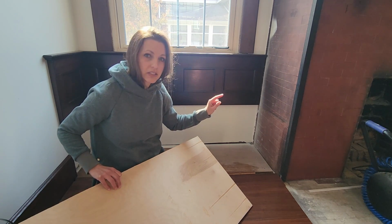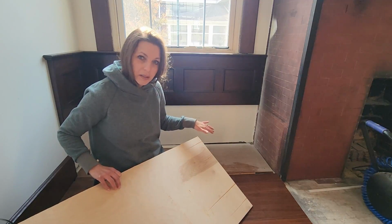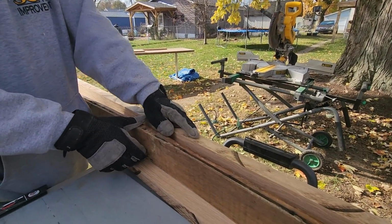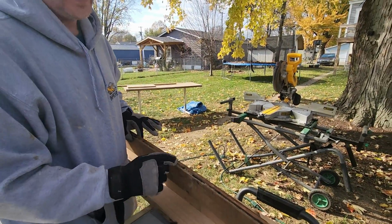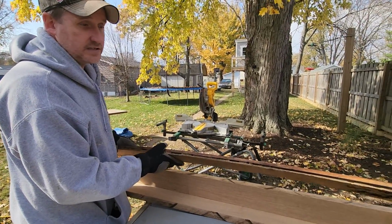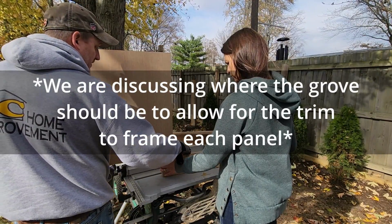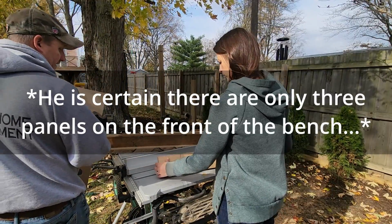So now we're going to try to rebuild it, reinforce it, so that won't be a problem anymore. We were able to find some white oak at a local lumber yard here close by. But we wanted to go with a little thicker board, so we ended up going with a 5/4 board, 1¼ inch thick, so that when we add this groove, it'll actually still keep the strength and stability, and hopefully it won't bow like this. Loose, I'll probably try to keep it right here and then just go a little bit that way loose. And that's still going to leave you a good chunk out.